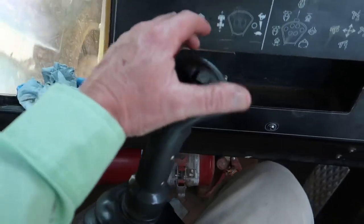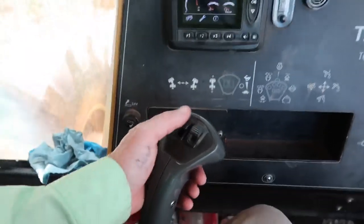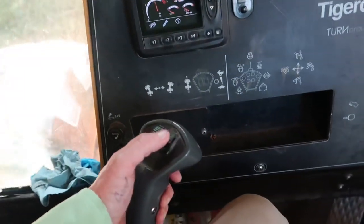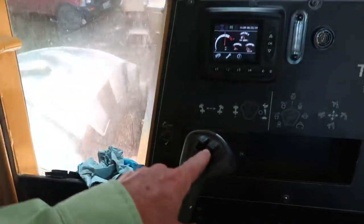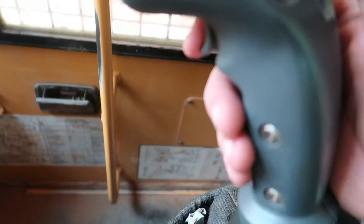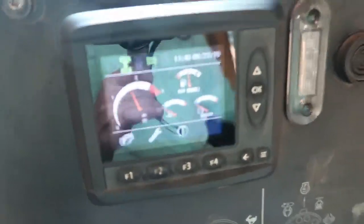So this is how you run this machine — this is your steering wheel right here, the steering stick. This way is right and that way is left. This is your forward and reverse — all the way up is forward, all the way back is reverse. That's your ground speed limiter: all the way up it'll run as fast as the machine will run, or you can limit it by pulling it back. You can also push it to wide open. It also locks your front end or engages positive traction — I just locked and unlocked it right there.